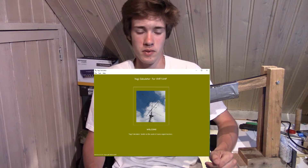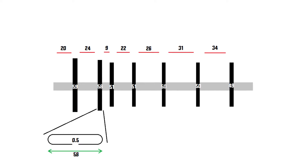Building one starts with the design — the antenna needs to be fine-tuned for the specific frequency your Wi-Fi operates at. In my case it's a 2.4 GHz network. I used a program called Yagi Calculator, where you fill in the frequency and the properties of your materials — wire thickness, boom dimensions, and so on — and it calculates all the dimensions for you. I then put those dimensions into a drawing to make construction easier.